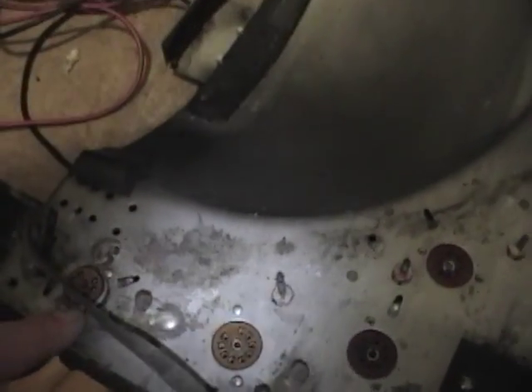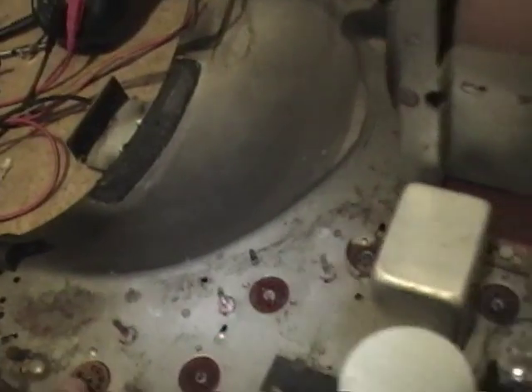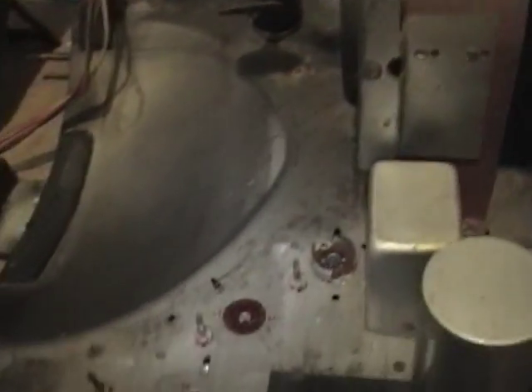Now I've added the miniatures - those I have to go hunting around for; I know I've got them, I'm just not quite sure where they are. I'm also missing all the tube shields. There should be one here, and this little spring clip on the side should go to a metal can that fits over the whole tube. For now I'll try running it without those shields - it shouldn't affect performance too much.